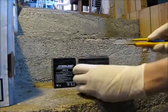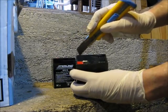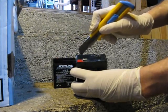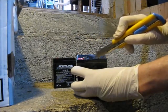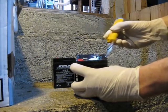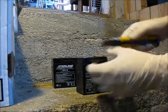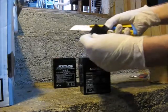In order to get one of these batteries open, you take your box cutter knife — you'll notice right around the top there's a seam. Run your knife across that seam a number of times, cutting into it. Try not to cut your hand slipping off the edge. Run your knife maybe three or four times down the seam — that's how they close them, just glued down — then start prying around the edge. And there we go, the lid's off.